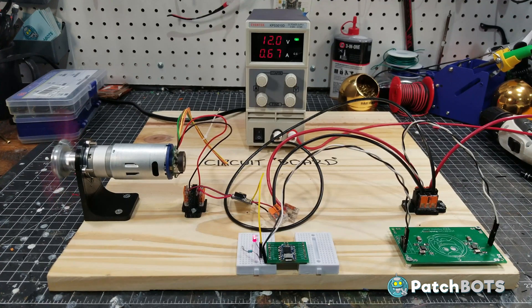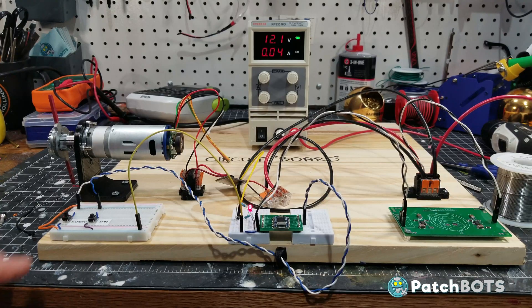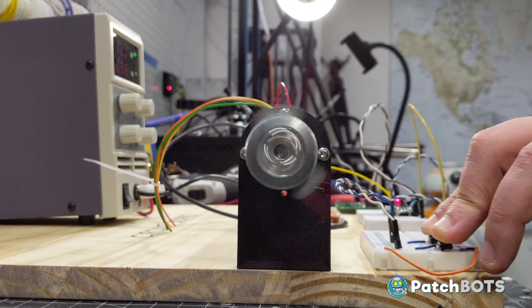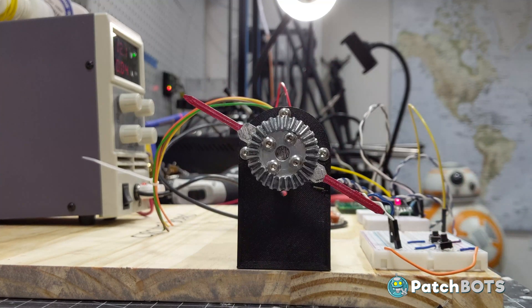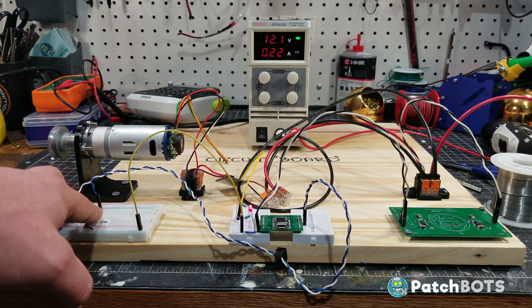This is all well and good but we don't want the speed of the motor to be determined by a program — we want it to be determined by the user, so we need to add some input. That input is going to come in the form of these two push buttons. I decided to go with two buttons to avoid any accidental triggering. When the two buttons are pressed the motor increases its speed up to the full 12 volts. The PWM value gradually increases from zero to 255 when the button is pressed, and when released it gradually decreases rather than just returning to zero, so it doesn't have to restart from zero and the spin stays nice and smooth.